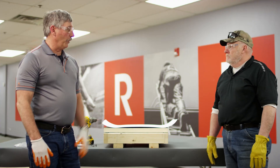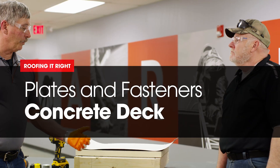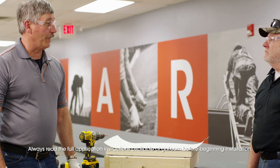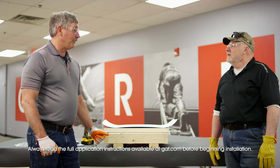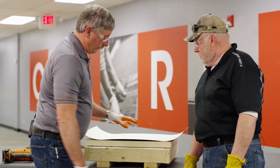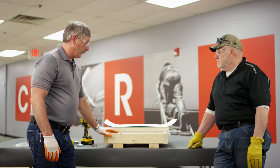Okay Dave, so we went through a couple other decks, now we're at our cement deck here. We're going to show people what it takes to actually do a mechanically tested system in a concrete deck. Here's our ISO, this is our mock roof deck, here's our sheet. I'm going to slide this back just to give everybody an idea of what it takes to drill the concrete deck. Right now I've got an inch and a half ISO.